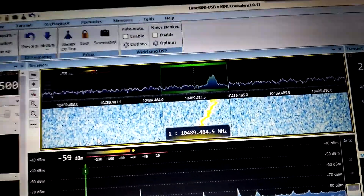It was very clear, and I was able to receive most SSB voice stations and listen to all the sentences they said. In that clip, the frequency drift was quite serious, but with the PSK beacon lock function in SDR Console I was able to reduce the drifting problem — the drift actually disappeared after I locked the frequency. For transmit, I was not able to quite receive my own signal directly, but on WebSDR I could listen to my own signal, confirming the uplink was quite okay.